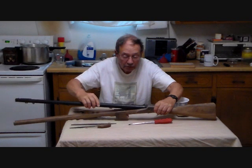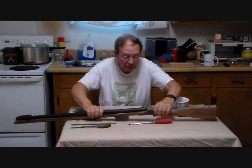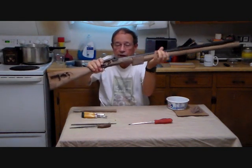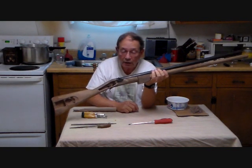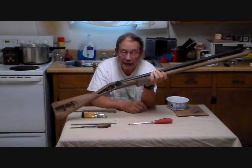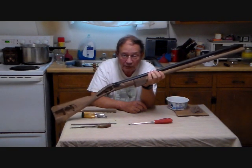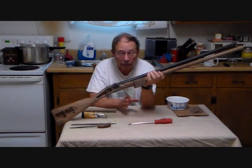As I have removed wood, it has dropped further and further down. Now it is not quite flush with the breech unless you really force it, which you do not want to do. The reason being is this long piece of wood — the stock — is the most expensive part of this gun you will buy. You don't want to split it by getting heavy-handed and crunching it down. You can repair stock splits, but it's better if you don't do it in the first place.